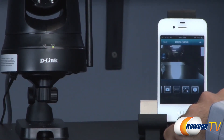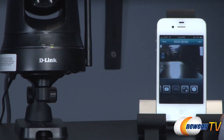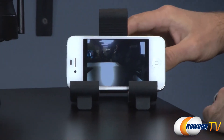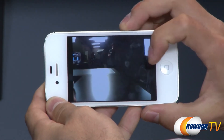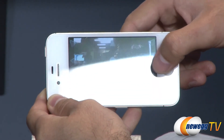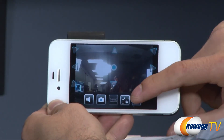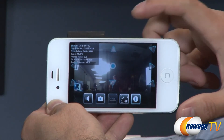It is at 480p, which is the highest resolution on this camera — 640x480 at 30fps — and it transmits using H.264 or MJPEG video codecs. This is an iPhone, but you can also use it on an iPad or Android device with the app for remote viewing. Turning it sideways shows the wider full-screen frame. Tapping the screen lets you pan the camera left or right, and there's a recenter button to return to normal. The information button in the bottom right shows current frame rate, bit rate, and streaming speed in kilobits per second.